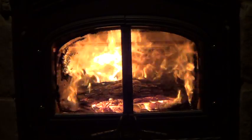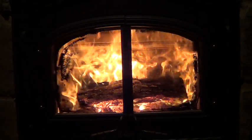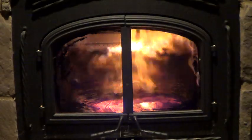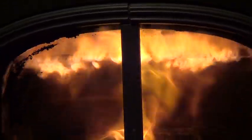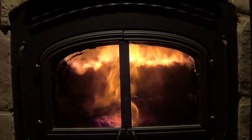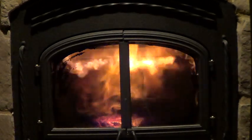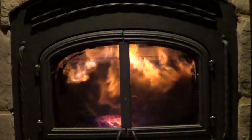Right now it's getting too hot — it was 66 degrees in here when I started, and it's moving up to 68 now, so I don't need it that high. I'm going to knock down this ACC and turn it to low, and you'll see these blue flames coming out of the top, rolling and burning all that excess gas. You shouldn't see smoke in these fires. That fire is just super white and blue hot. You can hear that cracking — it's like expanding cast iron — as it heats up it expands, so when I hear that cracking I know the temperature's going up.